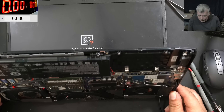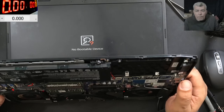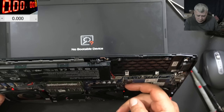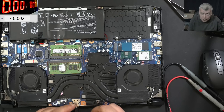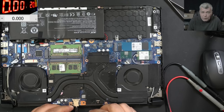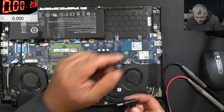No bootable device. What do you mean? The hard drive is inside. Do you think the customer wiped the hard drive? The chipset is getting hot, but that's okay, that's normal. Let me plug the charger. So if we plug the charger now, it's working. Not 0.7 — like 20 volts. Plugging in the charger. I don't have enough current — the power supply is limited. I can see the current.